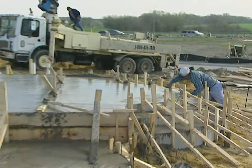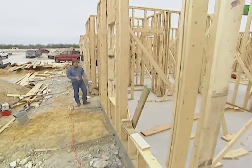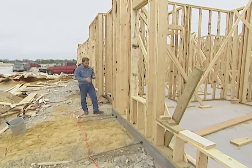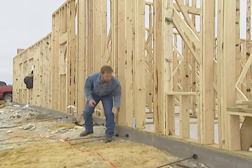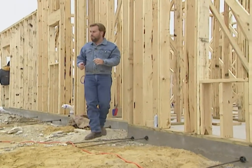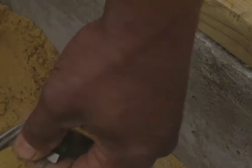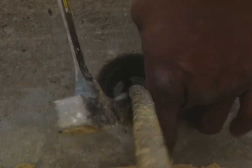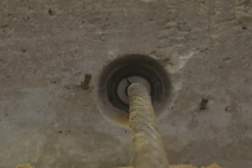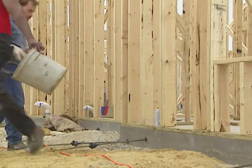It's been exactly seven days and our concrete has hardened up enough to go ahead and stress it and put tension on our cables. First thing we need to do is remove this plastic that's here on the cable and put some wedges in so the cable won't back in. Bobby from post-tension and steel is here to get the job started. He pulls the black piece off, then sticks some wedges down both sides — little pieces of metal — but they will keep the cable from backing back into the foundation once they put tension on.